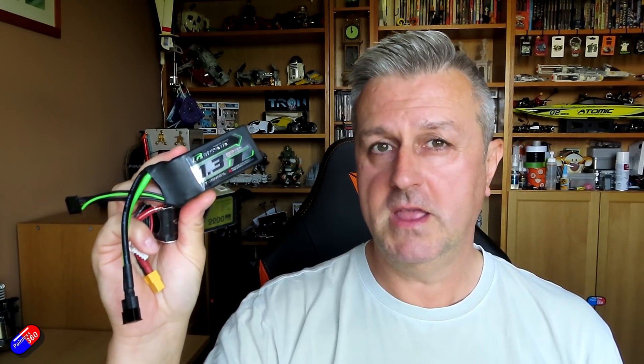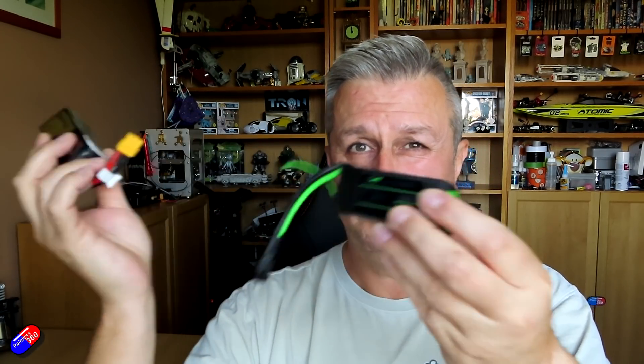The last one we'll talk about is LiPo batteries. The battery I was using inside my Diatone Ripper was this graphene pack from Hobby King - a 4S battery. For the same size of battery I can now get this Tattu battery at 2200mAh, which is pretty much exactly the same size and with only three grams more, pretty much the same weight, but about 70% more capacity - which would equate to potentially 70% more flight time. I'm so pleased that people like Tattu are actually bothering to make batteries for those of us who don't need 100C in their packs.